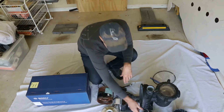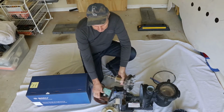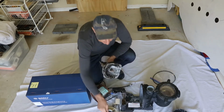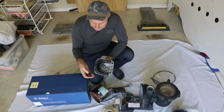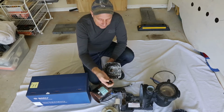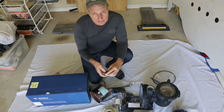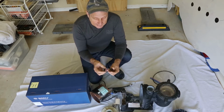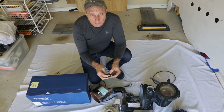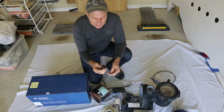There's a motor here. Typically these problems start in the dry end of the motor, and then there's the wet end of the motor. In the wet end you've got some basic stuff like the impeller to turn the water, but the part that's the killer of these pumps is these two little parts in my hand here, which is the bearings and the seal. Over the years they get dry and hard, and they start to leak water, and the bearings get corroded, and of course you've got salt water, they corrode out. They get noisy as those bearings start to chew down the metal.